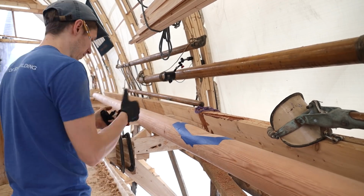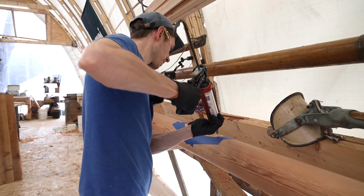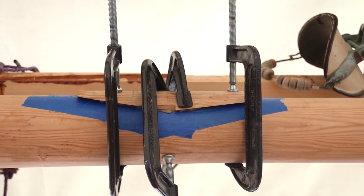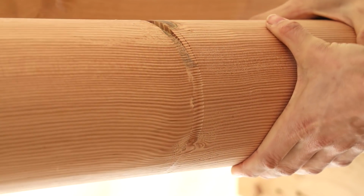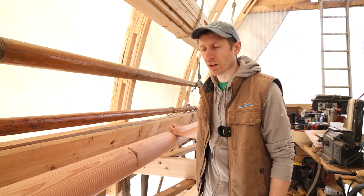So that graving piece where that sideways knot was has come out real nice. I haven't shaved it down yet. We're going to let it sit for a little bit longer, make sure that epoxy is completely cured, but right now I've got two more spots that I need to take a look at, and we're going to do a little bit different technique on how to fix those.